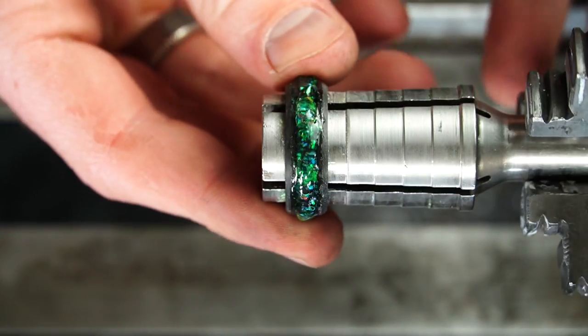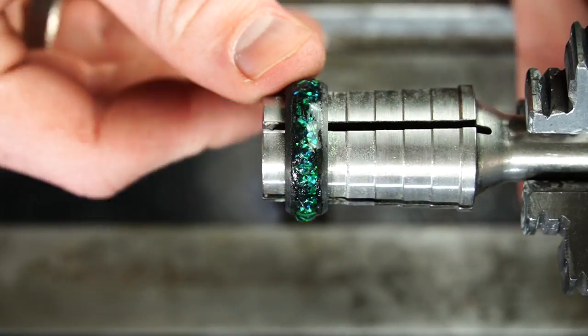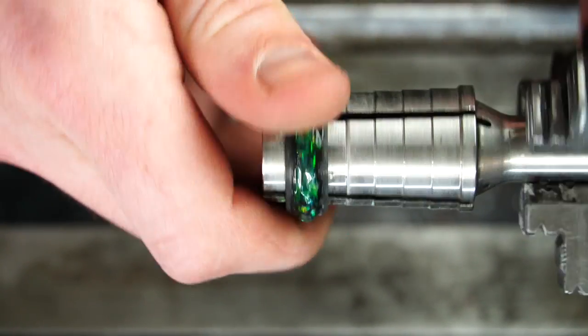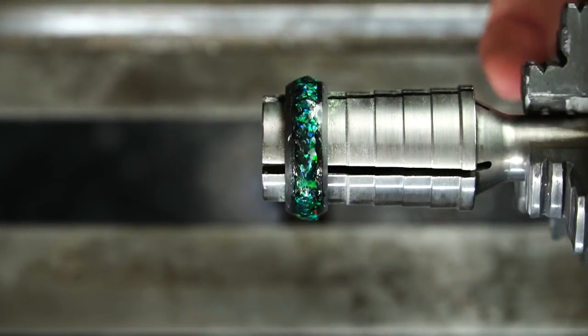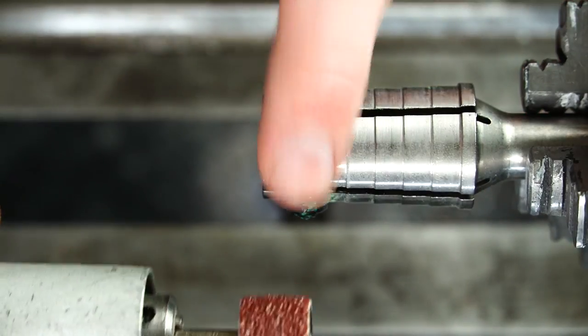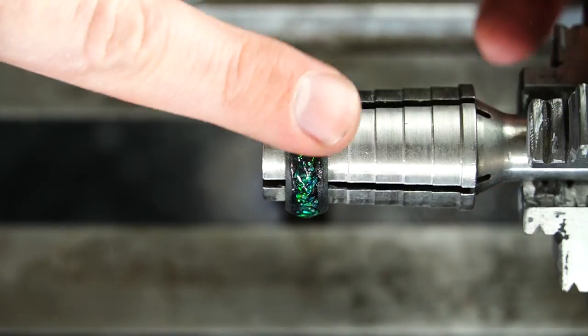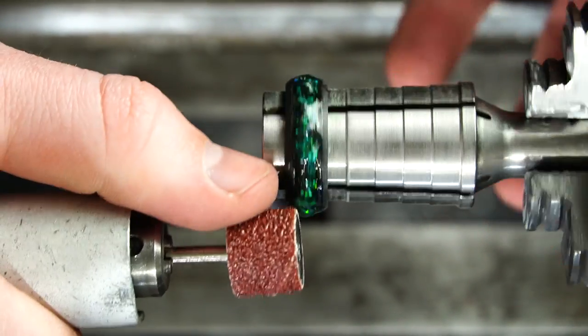All right, it's been 20 minutes. This is thoroughly hardened all the way through. If you're not sure, just wait another little while. Never hurts to wait. And if it's still a little bit wet on the inside, it's gonna give you problems, especially with trying to make the inlay nice and clear. It's gonna get all sorts of debris stuck in the sticky CA adhesive underneath, and it's gonna be terrible. So yeah, ready to go.